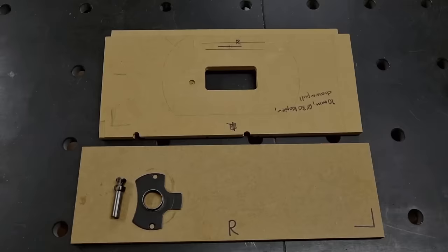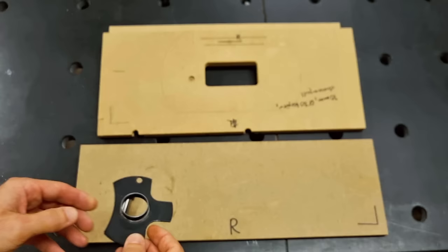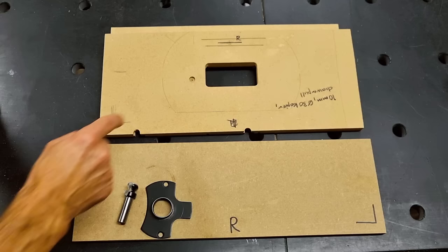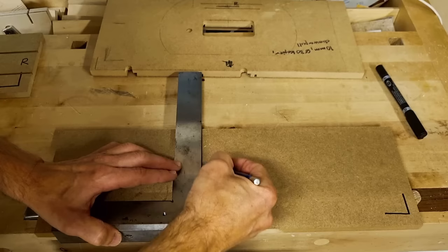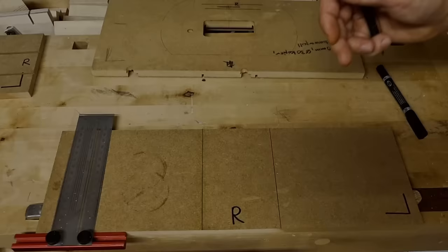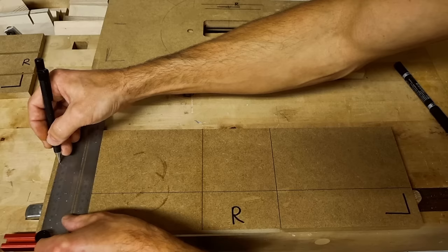To make the actual pull grip feature later I'll use a router pull grip bit together with a guide bushing in my router. Using a guide bushing means the pull grip feature will be smaller than the hole in the template — I'll leave that offset for you to calculate. Since exact dimensions aren't critical for today's video, I eyeball the layout based on my old template, making lines edge to edge in both directions.